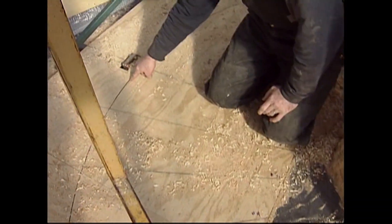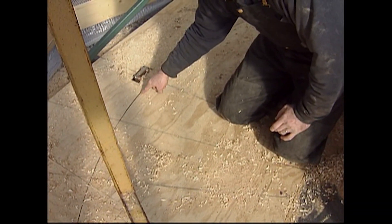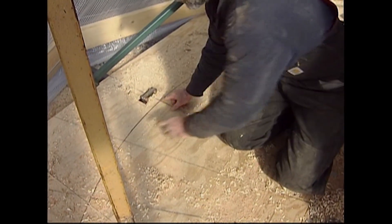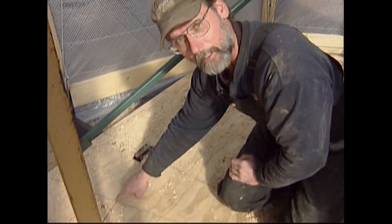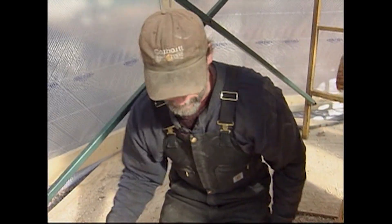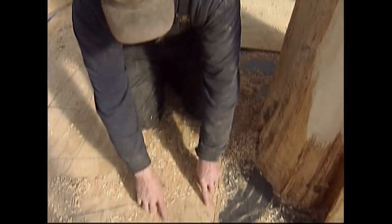We started with a circle that's 360 inches around. Each stair tread is 12 degrees, so we've got 12 inches on the perimeter outside of our circle to get one stair tread — one stair tread, 12 degrees. We've got it all mapped out on the floor here and we're using centerline design. That's the only way to measure this out.